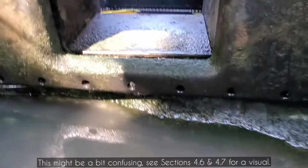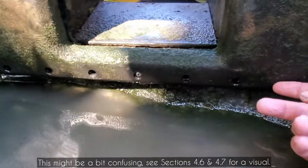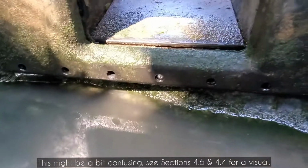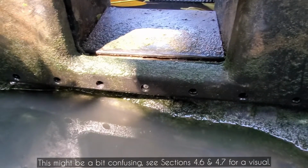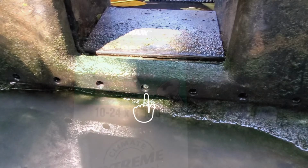The reason I do this is you have to have room to put your hand to hold the nut on the inside underneath the rubber sheet while you're tightening the bolt from the outside with a screwdriver. This process is very hard to do, especially if there are bolts sticking through that you have to wiggle your hand around to get to one further towards the middle.